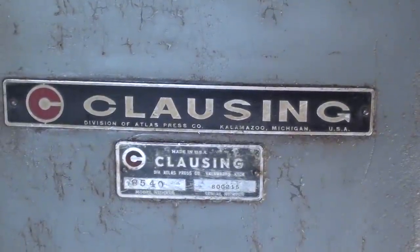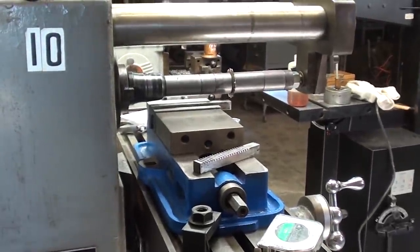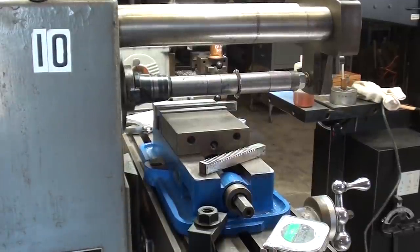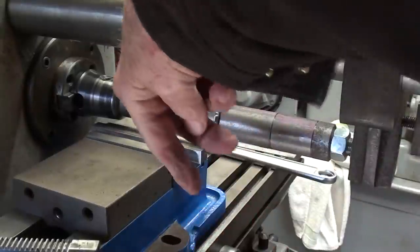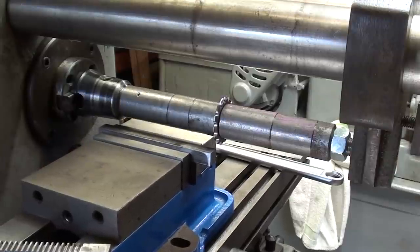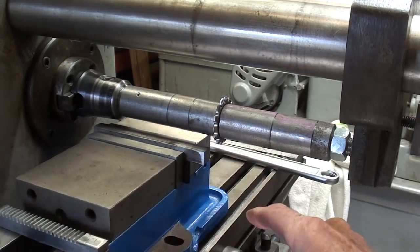All right, you're on a field trip, whether you like it or not, and we're in the garage here at the Clausing Horizontal Mill. And it's warmed up a little bit here. First week in March, it is 60 degrees in this unheated garage. This machine has only 5 inches of travel in this axis. So I put a dummy piece, 5 inches long, of 1/2 inch keystock.